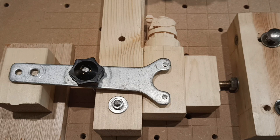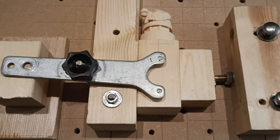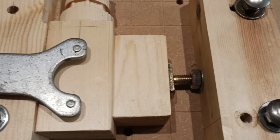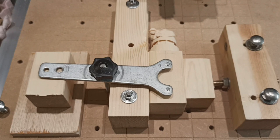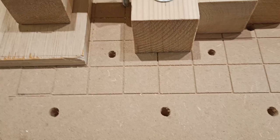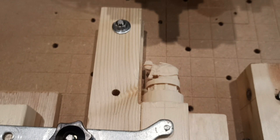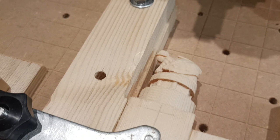And it's so important to keep the material clamped down tight to the board, and also perfectly in line with the y-axis, which is why I've got a little clamp just there, which is pushing the material up against the stop that I've got fixed down onto the spoil board. I've got little inserts under the spoil board, and on this machine I've actually got a double thickness spoil board, but as long as you make sure that you get this material clamped down perfectly well and that the spindle is free. I've also taken off a little bit of the edge of the support board there just to allow the tool to have a little bit of clearance. Okay, so we'll carry on.